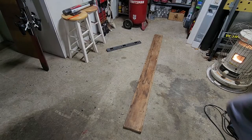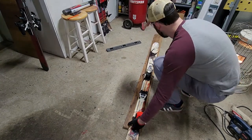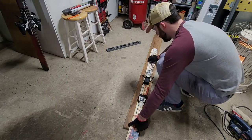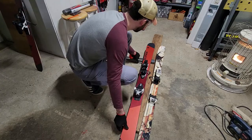I'm using this one inch by six inch piece of lumber — two by six is way more common but I had this lying around. To figure out the desired length of my workbench, I laid one of my skis on top and roughly determined the best placement for the ends or stands that would give me good support on either end of the ski. I did the same with another of my skis to double check and ended up with 38 inches being a good length.